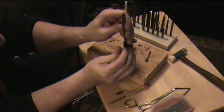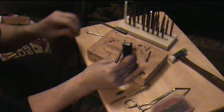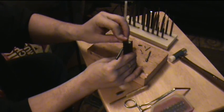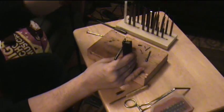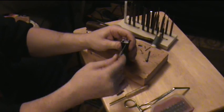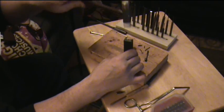Use a drift pin punch that's small enough to fit in there, drive it in there to hold that spring down, just like that. Get that spring held down, take your plug, put your plug in place. If yours fits loose enough that you can just push it in, great, which mine doesn't. But if not, just give it a couple of taps so it's in there far enough to stay in place. Pull that drift punch out, and then finish tapping that in until it's flush.